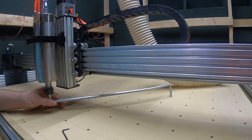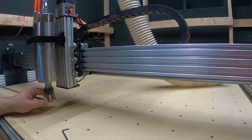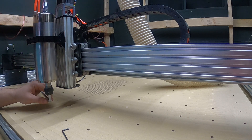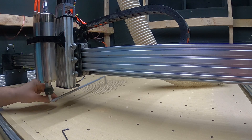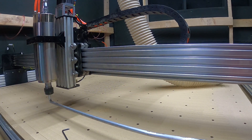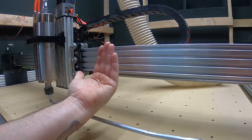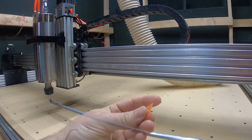There we go — making contact there. A little bit more contact on this side than this side, so we're going to give a little tap. This is snug but loose. That's pretty good. So we've got left and right sorted. I knew going in, because of the wasteboard, that I needed the head to come back this way a little bit to stop this angle.